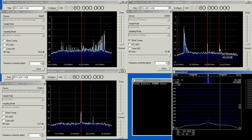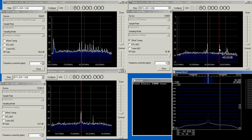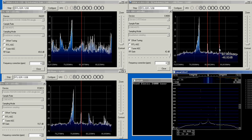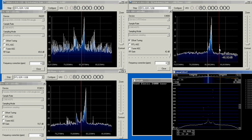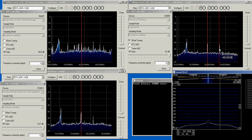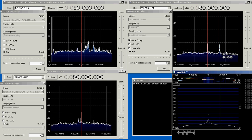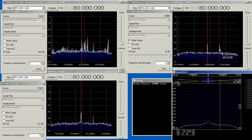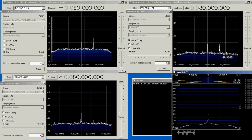You can see the R820. Compare the Linrad screen to the other screens — here is the real signal. Look at the signal at the side of the markers on the right hand side, on the E4000 dongles. You can see that the signal would be heard in the loudspeaker without interference from the sweeping signal. Now the signal is very close to the end, and here it stopped.